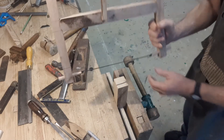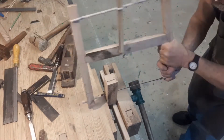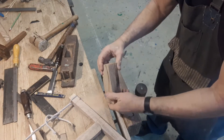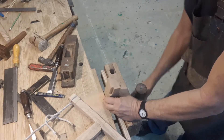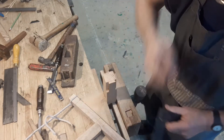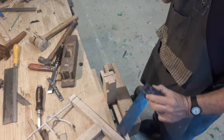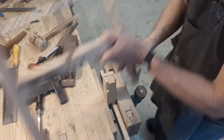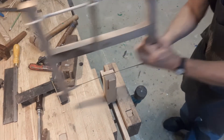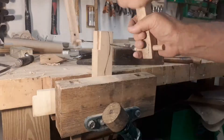I'll do the rough cut with my bow saw. After our great winter storm last year, there was plenty of oak on the ground and firewood was free for the taking. I got enough to keep my smoker going all summer. One piece looked nice after I split it, so I saved it to make this saw. I need to finish smoothing it, but that's another project. The blade is salvaged from a broken bandsaw blade — I welded a tongue on each end, and it cuts better than it did when it was on the bandsaw.